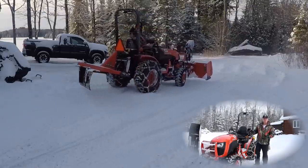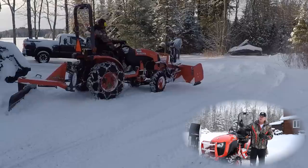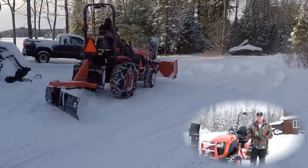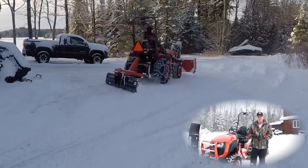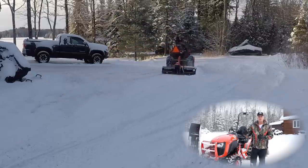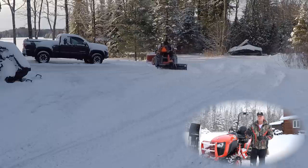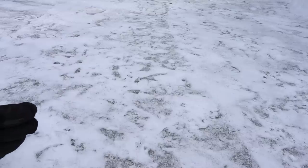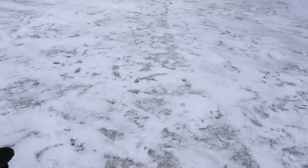On today's video, I've cleared the parking area and the driveway leading into the parking area. What I've done is used the blade in some cases, sometimes just the blower alone, and in some parts I've used the blade and the blower together, so that you can see the difference in the results of each of these attachments. Simply put, the blade is like a scalpel — it'll drag and scrape as much of the free snow off of the base of the driveway so that it gets it down as low as possible.